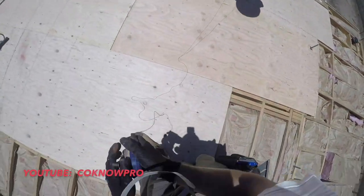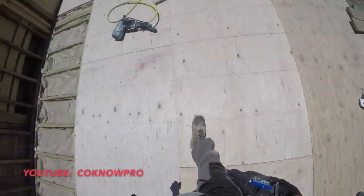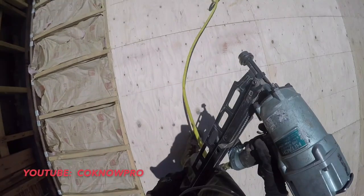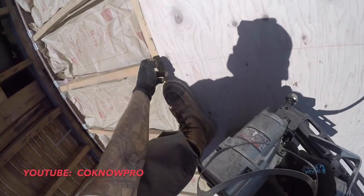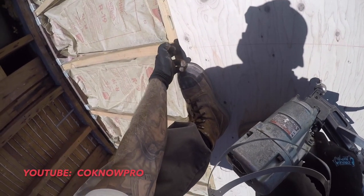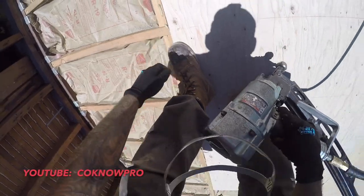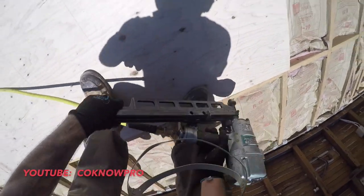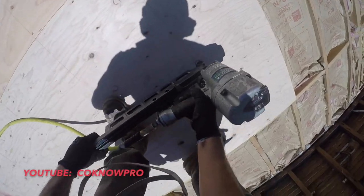That's good enough, brother. You're right on the line. Alright, now what we'll do is we're gonna go through and nail this thing off. First things first. When you put a nail there, you don't wanna get it too close to the lip, because you don't wanna get inside that female edge for the plywood there. You can call it a slotted edge, whatever you want.